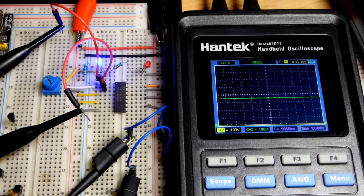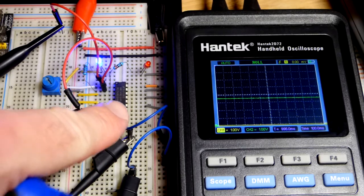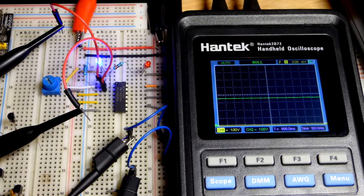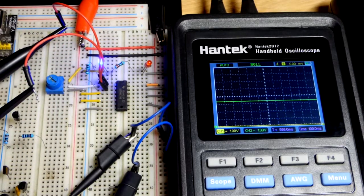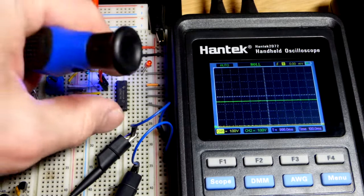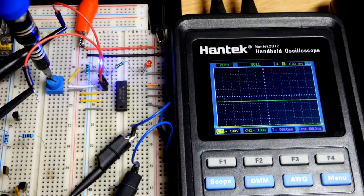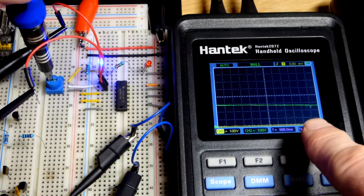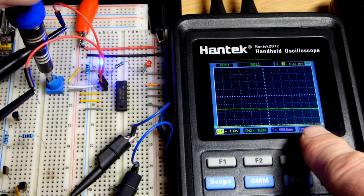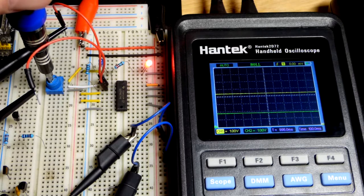for whatever reason. So I finally got the part that I ordered, which is the same basic component, except for it solves that problem. And now I had pulled out the 74HC04 and inserted the 74HC14. It has the same pin layout, so we can do that. But now you're going to see that when I lower the input voltage, we got to go down to about 2 volts. Then all of a sudden you'll see that the output jumped high, jumped right from 0 to high.